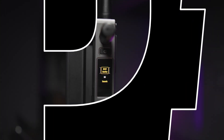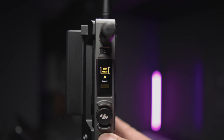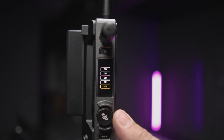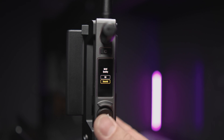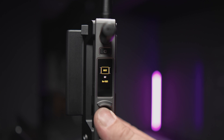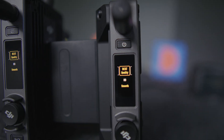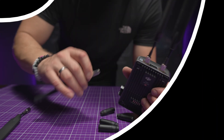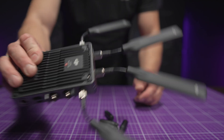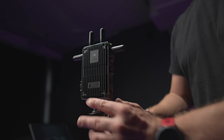Next tip: video mode change for better performance in broadcast mode. You can set HD mode where transmission bitrate is higher but with fewer available channels, or you can choose smooth mode where bitrate is lower with lower video quality but more available channels. If multiple devices are working in the same place in broadcast mode, try to make them all work in the same mode. You can also improve the operation range by using high-gain antennas and placing the receiver vertically on a tripod.